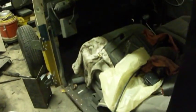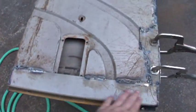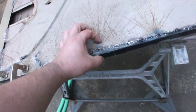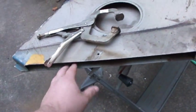Next I'm working on getting the passenger door welded — I'm actually working on it right now. I'm making it a lot beefier than the driver's side because I know passengers will be using it and they'll hang on it. I've welded extra angle iron pieces in. The top, instead of being one piece of metal made to fit, is actually a box that slid in there and is welded in. The same thing will happen with the other side — I'll do that tomorrow.